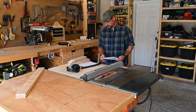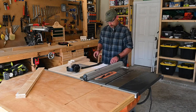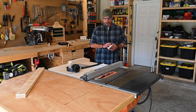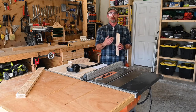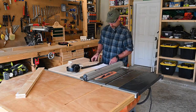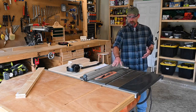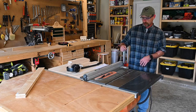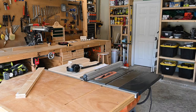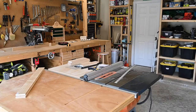So next, we are going to cut an 11/16 rabbet on all sides for the back, where the back will fit in, and then plus the French cleat. And I'm going to cut it 3/8 deep. So to find an easy way to find how high your blade is set, you could get some kind of gauge and try to measure it. But really, the easiest way to do it is, let me find a piece of scrap wood here. Let's try this one.